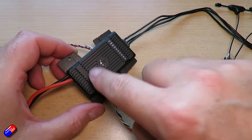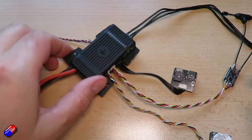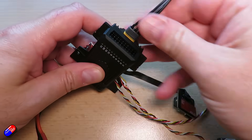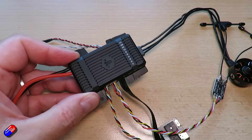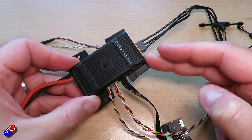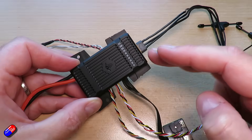Let me start with a quick overview of the flight controller. I have a GPS installed, a receiver, the remote auxiliary USB box, cables ready for the HD FPV system, and a spare connection for CAN bus. Power comes installed at the front, and we have PWM connections out the back for servos, VTX, camera, and another UART. Inside this little box is an H743 processor with an IMU and barometers. It runs from 3 to 6S, though I've heard of people running it on 2S without a problem. BEC battery voltage is configurable on the servo outputs at 5, 6.2, 7.2, and 8.4 volts, all at 5 amps. There's also a 5V 1A supply in here as well. Seven UARTs — not all of them are presented, I'll show you that in a minute.